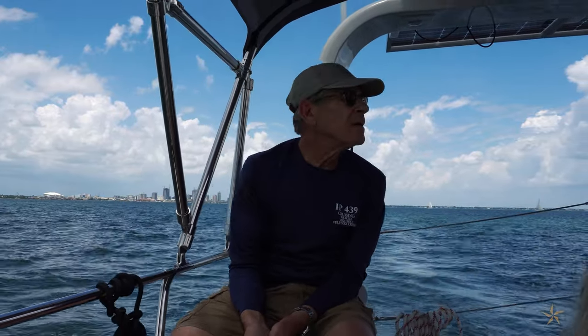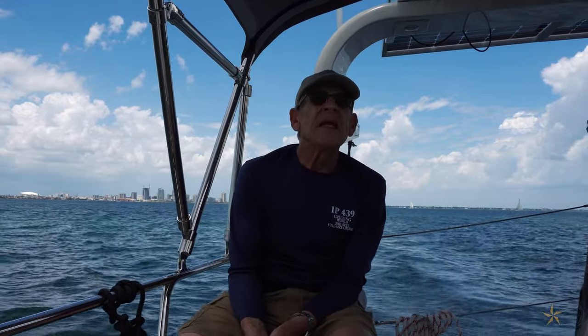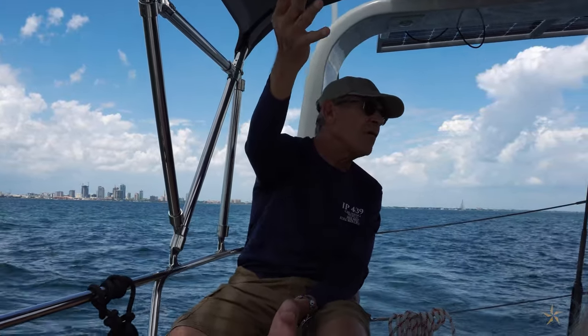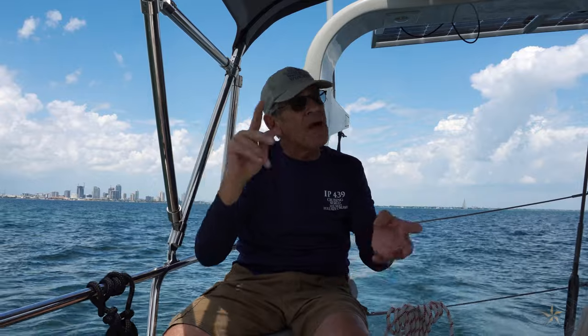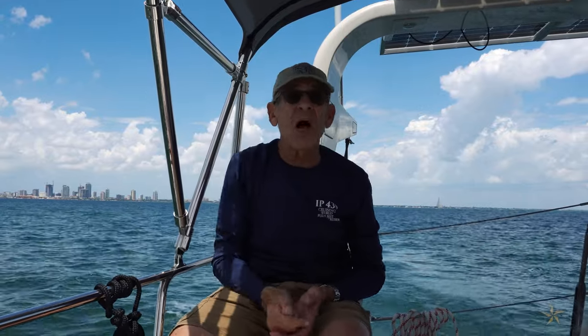And under heavy winds, they do well too? Very well, yeah. Anything over really 15 knots, you'll be using the main and the jib, and they'll hold their shape better than a Dacron sail. And of course, with the main and the jib, the boat becomes self-tacking. With the reacher up, we have to roll that sail in, unless we have a relatively trained crew. We have tacked it or jibed it through the slot before.